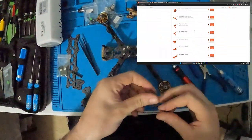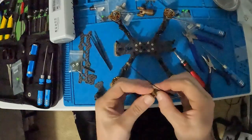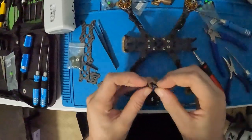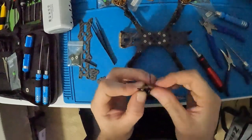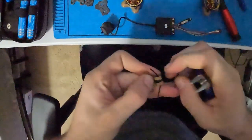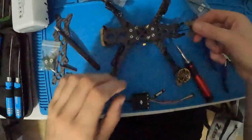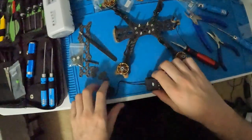There's also a receiver antenna to mount — this piece is available online and I'll have it linked in the description. It holds a 2.4 gigahertz antenna. This is a real pain to get in, so expect some fast forwarding. Feel free to really open this thing up and put a lot of pressure on. With the help of pliers, we finally got it. Now set that off to the side and on to the air unit. Like I said, this is the top but we're going to flip it upside down. Let's get the antenna installed on here first.